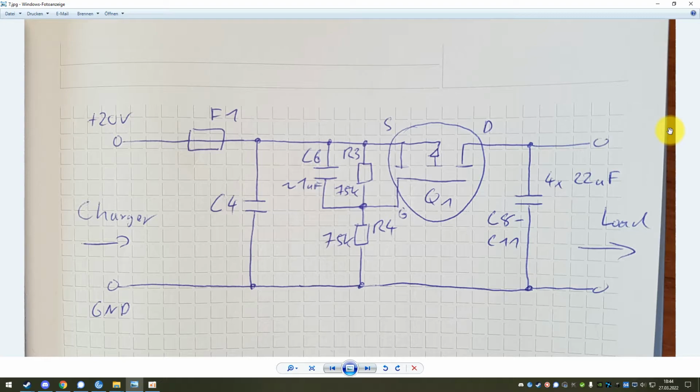And this can actually be quite high. It can be in the hundreds or even thousands of amps for a very short moment of time, so a couple of microseconds, maybe a millisecond or something. And this sort of current will over time damage your connector, your DC plug that you plug in the laptop, because that's of course not able to handle such a current, especially when it's still moving and there is arcing and so on. So when you don't have an inrush current limiter, you will over time damage or wear out your connectors.